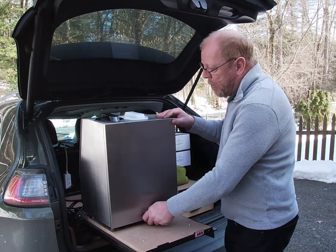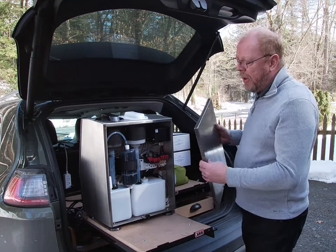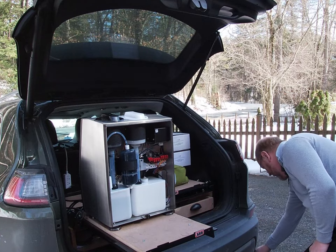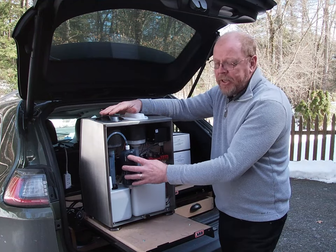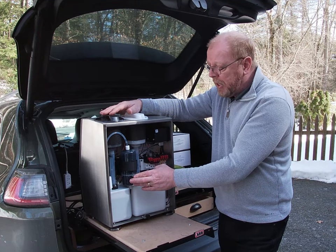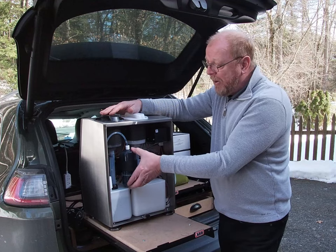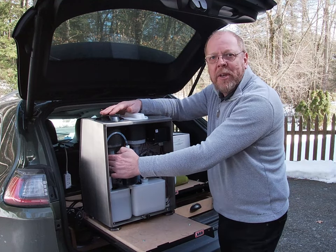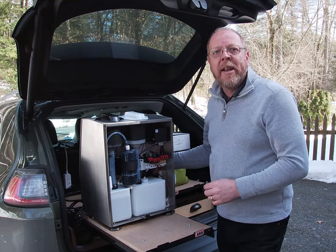If we look inside a printer, it's very simple to access from the back — just lift out the back cover plate and pop that to one side. In the back of the printer you've got great access. This is the 10,000 hour main filter. We have three parts that need changing every 12 months: the main filter, a small pre-pump filter at the back — like a little disc filter — and your air filter for the clean air intake.